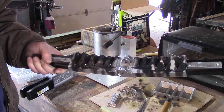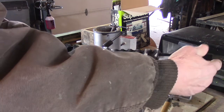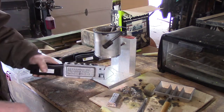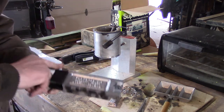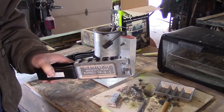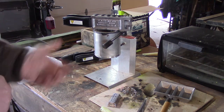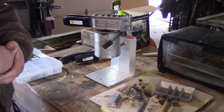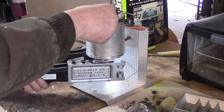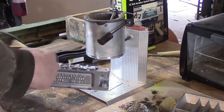The next thing is to heat up the mold. There are a couple of ways to do that. You can fill the mold with lead, which is what I prefer — you can do that on jig-type molds with a small hook slot, the lead solidifies and you can remove it. You can't do it on certain molds like blade bait molds where the lead runs out the bottom. Or you can set the mold on top of the lead pot and let it come up to temperature, which takes about 10 to 15 minutes. I prefer the quicker way.